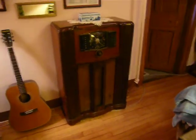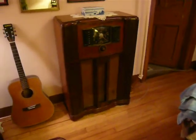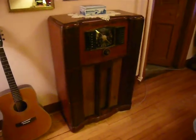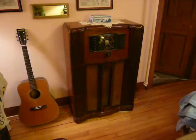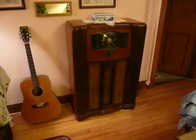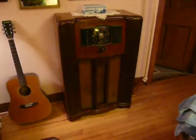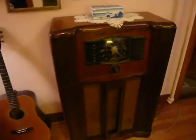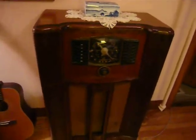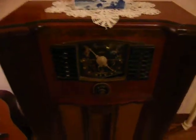This was made right after the time that Zenith had decided to switch over to rubber wiring, and the types of rubber that they used back then were not really that well preserved. Most of them have sort of crumbled. The good thing about these radios is that once you replace the wiring, they work pretty well. This one has had most of the wiring replaced.